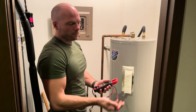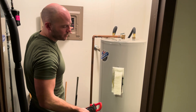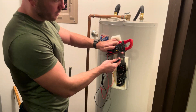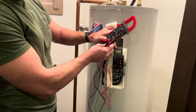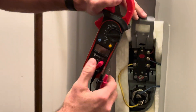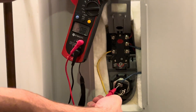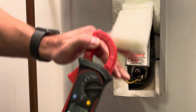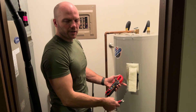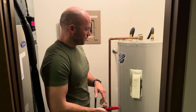One thing you can also test if you feel like it's not working properly — this is a little more dangerous so you have to be careful. With the power on, and having turned the temperature up so the water heater should kick on, you can test your elements on whether they're actually getting power by adjusting your multimeter to volts with a little wavy line — that's the alternating current — and then you can see if it's getting power. This one is getting power right now, so it's getting hot. They don't both work at the same time because they're on different thermostats. It may take a minute to wait for the other side to kick on, but touching the screws while it's on will show you the amount of volts getting to the element.